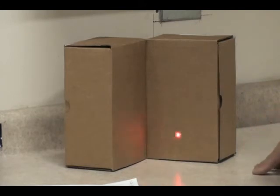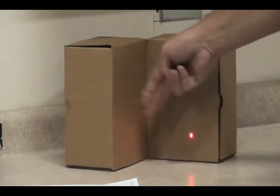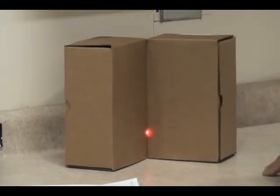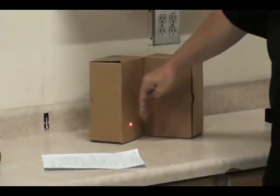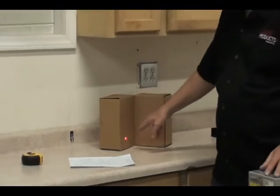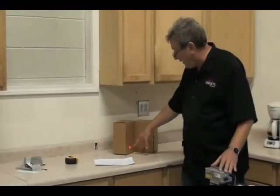What you need to do is measure outside the corner where there is no reflection. If there's a mud build-up in the corner, you drill into the corner right there, then come out three inches — that's plenty of distance to capture that mud build-up in the corner, which is only two, three, four inches at most. We'll show you on the board in a minute how that looks.